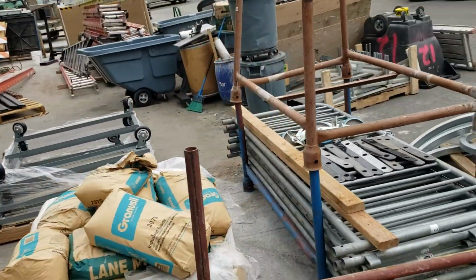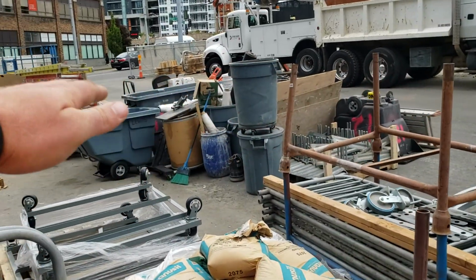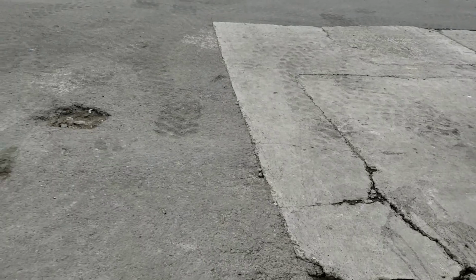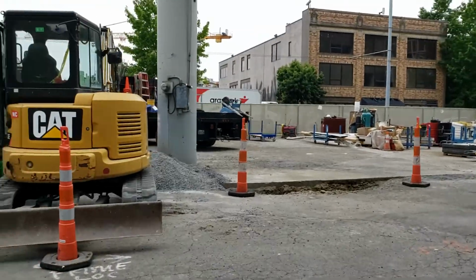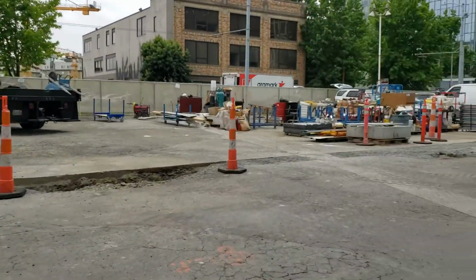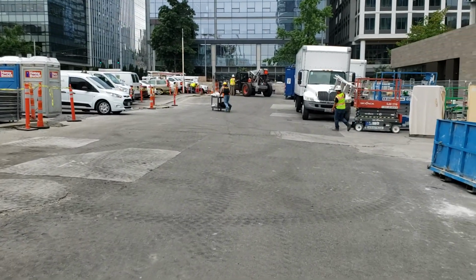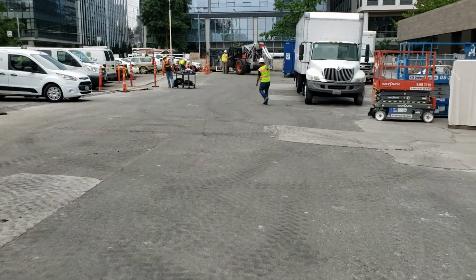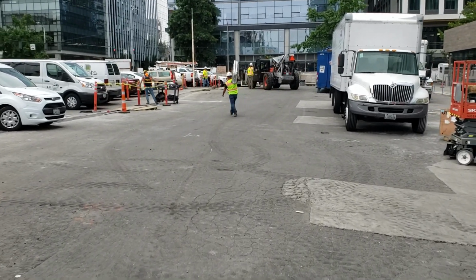What we're gonna have to do in between them is ramp up and then back down, because they're almost flat as it sits. So we'll need to kind of build our own flow line through there. Also, this big thing is staying, and then they're doing light poles all the way down. They needed to know what elevation they want the last light pole at, because that's the only one where we're locked in, and that light pole is where we're doing our ADA stalls.